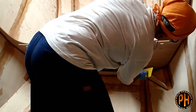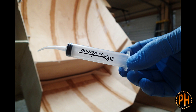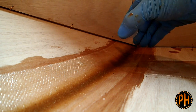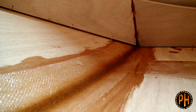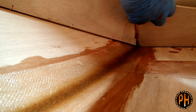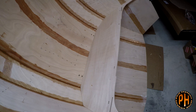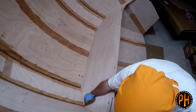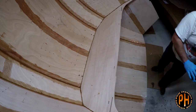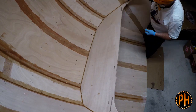With the hatch stiffener, I experimented with applying the thickened epoxy using a syringe and leaving the stitches in place that were holding the pieces. These wouldn't be left buried, so I thought it would be worth gluing them together and then pulling the stitches. This worked well in our kayak build, so it should here. If you are in a rush, this might not be the best choice since it means you have little gaps to fill in later. The syringe can help you push thickened epoxy into small crevices and may be better when used to fill in small seams on the outside rather than where you are applying broad fillets.